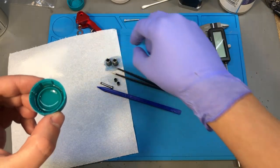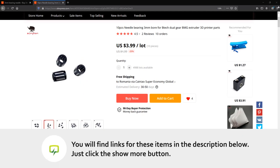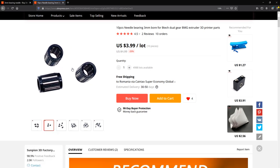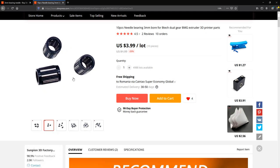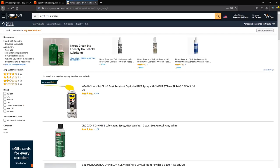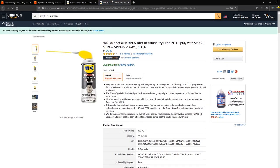My bearings are still in working condition, but if yours got damaged it's good to know you can order a replacement set from Aliexpress — fairly inexpensive for a set of 10, and I'll put a link in the description below. You generally don't want to use a wet lubricant or grease on these parts because that will gather up dust and the grease becomes a thick gunk loaded with particles. A dry PTFE lubricant is preferred for these kinds of applications.